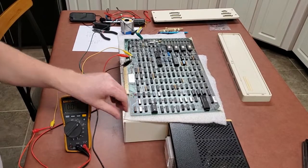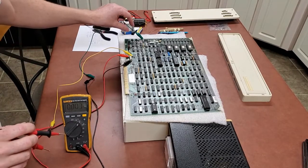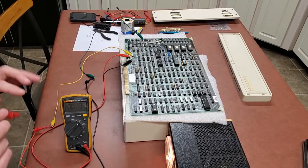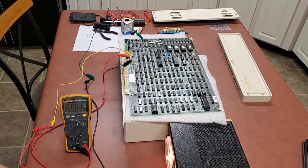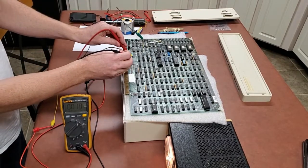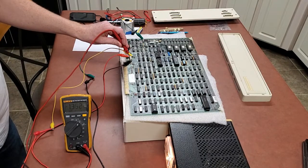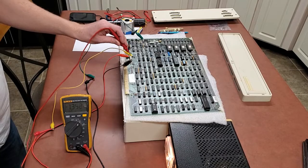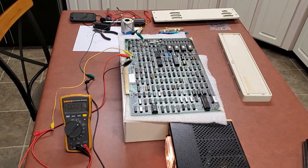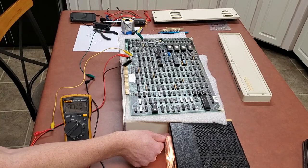I put the board on a piece of foam to keep it from sitting on the metal case. I've got negative 12, positive 12, five volts, and ground connected. When I power this up it's only going to put five volts on the five-volt part. Measuring at the board I'm only getting 2.5 volts — going across the power cable it's dropping 1.3 volts, and across the ground it's dropping 1.2 volts. Current is only one amp. This cable must not be good enough — I've had a lot of trouble with those cables and bad connections at the ends. Let me find something better.